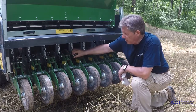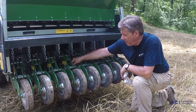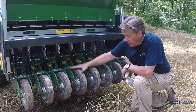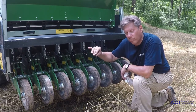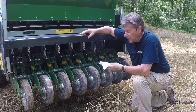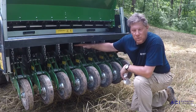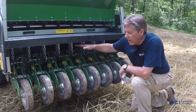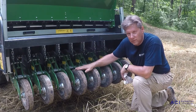Basically, you have a weight transfer system. This pin that we're adjusting limits how far this bracket comes down and impacts that pin, which transfers weight to your press wheel. Your press wheel is going to close your seeding slit up to a certain degree, but more importantly it's going to improve your seed-to-soil contact, help your germination, and get it coming up. From a geometry standpoint, this allows the machine to drop further in the ground or raise off the ground while your press wheel remains at the same location, riding on top of the ground.